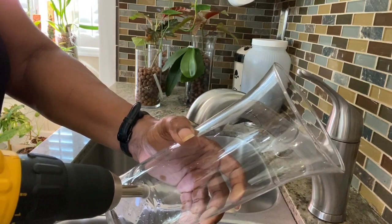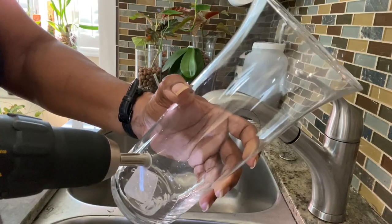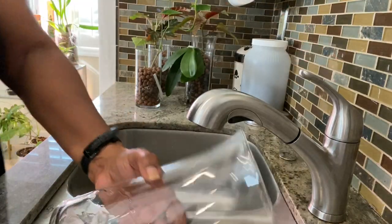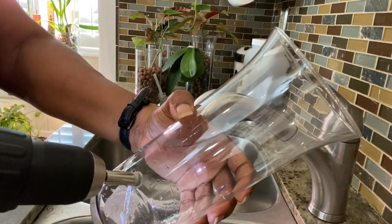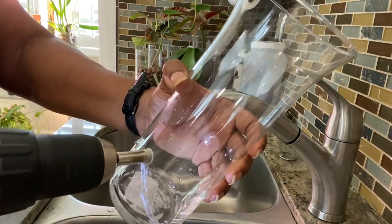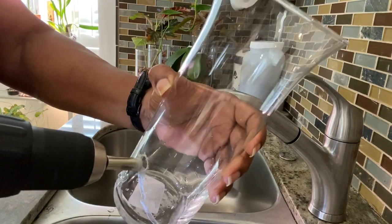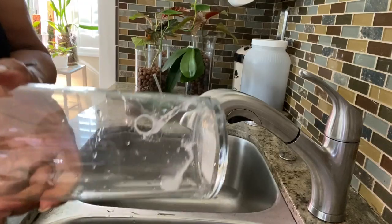You do have to be patient. It takes me about a minute and a half to two minutes to get a hole in a cylinder without rushing. When I first started, it took me well over five minutes per hole. You'll also see me rotate the drill head slightly — what I'm trying to do is even out the hole, because we started with one side of the drill on one part, and that part is much deeper than the rest. So I rotate it a little bit to even things out. Eventually you're going to hear a crushing sound, which means you've broken through at least on one side of the glass. There's a little crushing sound when it's breaking through — and there we are, we have the hole in the glass.